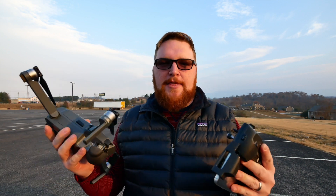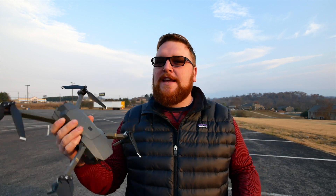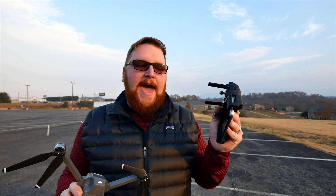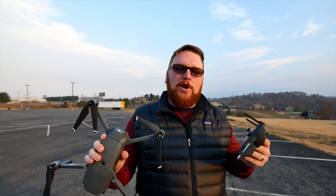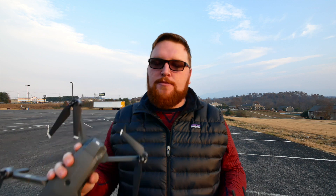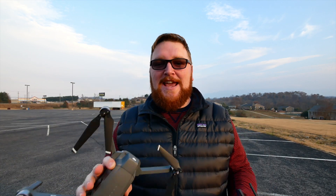Today's video is on just the initial setup and the things that you do for your drone. Obviously, if you've got the Mavic Pro or if you're waiting for it, the very first thing you're going to do is charge your batteries. After you've done that, you're going to connect your phone of choice to the controller. All you have to do is power on the drone and your DJI Go app on your phone and the controller — it's all going to sync up and it's going to tell you to upgrade the firmware. You'll just hit one button, it'll download it, do it all for you. It's super easy, super user friendly. So the very first thing before you fly, you need to make sure that your firmware is up to date.